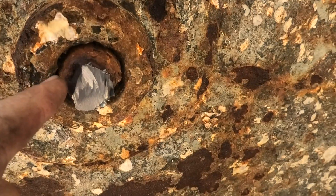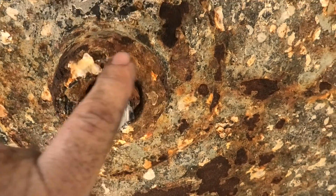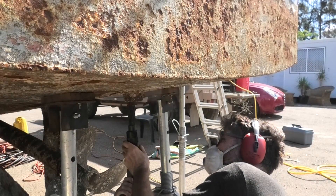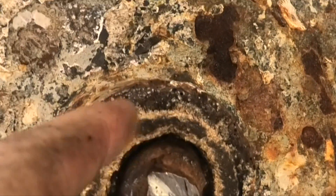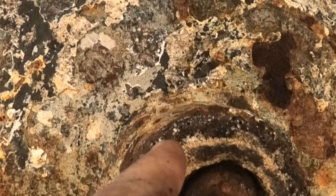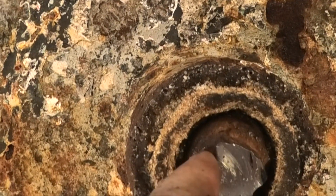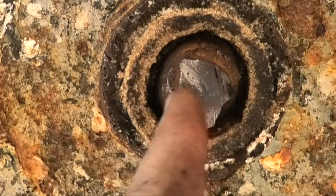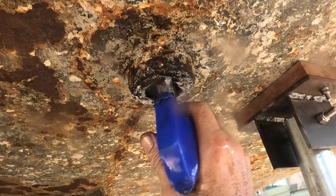Hopefully you can see how quickly the rudder post goes back up to its full width. I'm going to get the needle gun and chip away here to see what we see. Looks like we've got steel here and then probably some sort of nylon bushing. Looking up, this material chews very easily, so I'd say it's some sort of soft nylon bushing. I think what's happened is the tube has corroded, the metal has swelled, and now the bushing is really gripping hard against the shaft. I don't see any evidence of a threaded locking mechanism or circlip — I'll give it a squirt from this side just so I feel like I'm doing something.